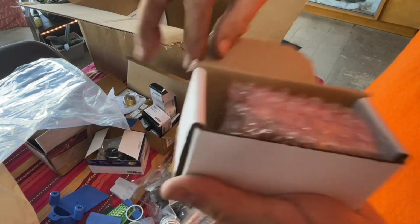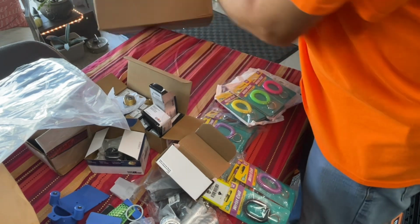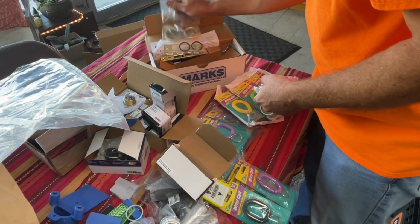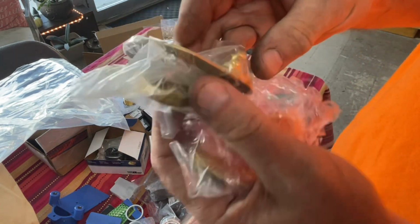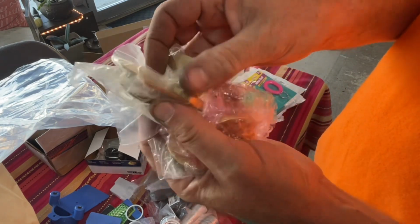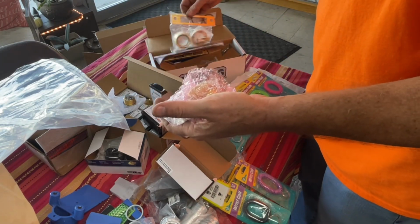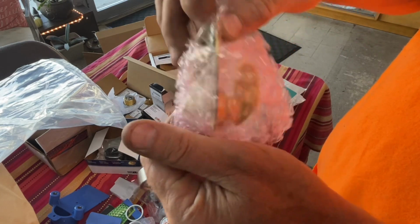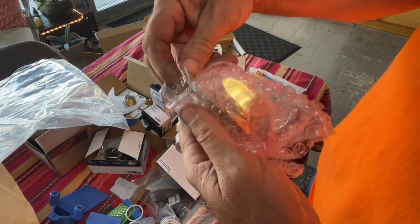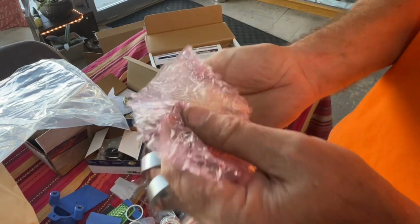Marks 197. This is a thumb turn conversion kit that goes with this lock. This is how this lock comes. So basically, instead of using a key on the inside, you would have this thumb turn that attaches to this guy. All right? And that's kind of what this is. So what I'll be able to do is, if I run up on any one of the double cylinder versions, which is popular around here, and if it's for a HUD rental, it has to be a single cylinder. So this is the conversion mechanism for that.